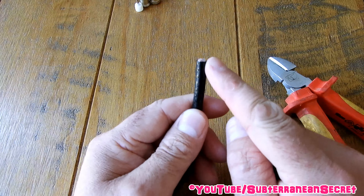All we need to do now is grab our coaxial TV plug. Again this comes in four pieces. The first piece is the back piece — slide this over the cable. Then we get the clamp; in some cases you may need to open it up a little bit to make it fit over. Make sure the little strands are all nicely compact together and not touching, then slide the clamp over and press it down over the small copper strands.